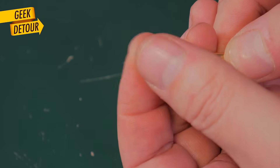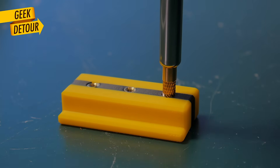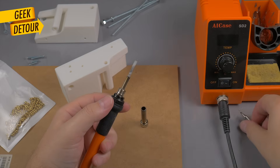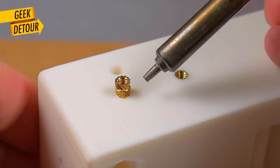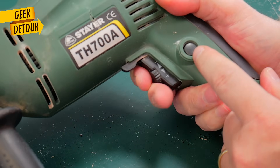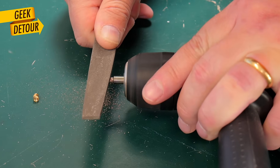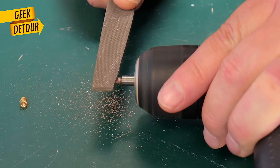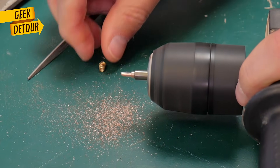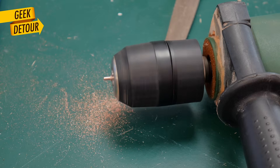Here is a proper set of tips for brass inserts. They are straight, so they push down guiding the insert and leave the insert there. But you can make your own tip in 5 minutes. The idea is to get a normal soldering tip and turn it into this. If you have a worn-out tip, even better — this one was trash anyway. I used my drill as a lathe and shaped the tip with a file. It's not difficult. But if you are not comfortable with power tools, just buy a set of tips. They are not expensive.